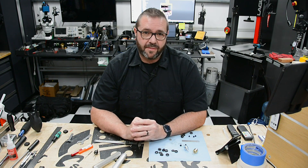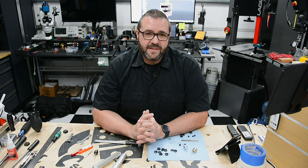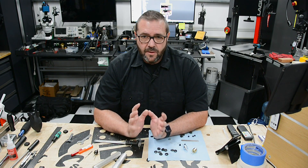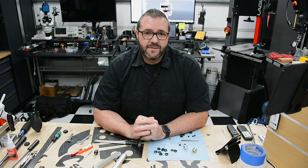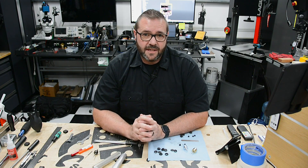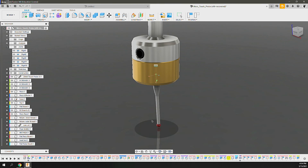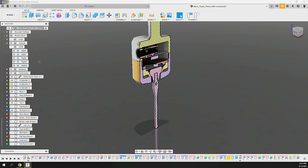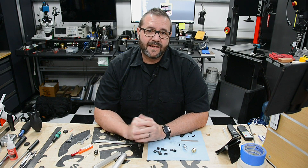Meanwhile in Fusion 360, while adding the headphone jack greatly simplified the body design, reworking the piezo platter took more thought. The requirements driving this change were: the piezo needed to be floating and able to flex to detect the minute vibrations of the slightest touch; the probe mount needed to interface with the piezo in a way that captures minor touches during probing; the tray should also absorb large movements in the event of a crash - it shouldn't break if you crash into your stock. Solutions online tend to super glue probes to the piezo, which won't work for repeated edge probing. Finally, the tray needed downward force to keep it seated against the grub screws.